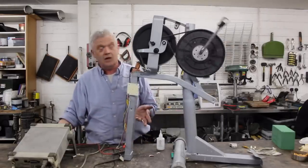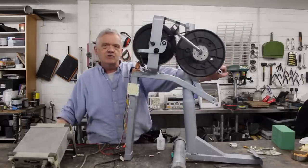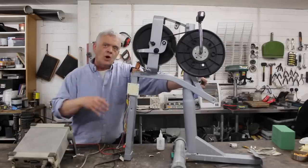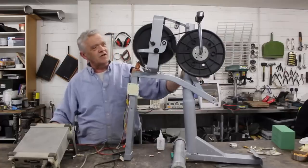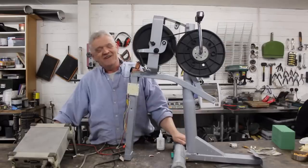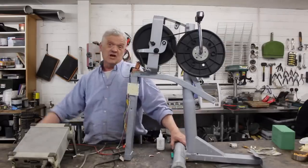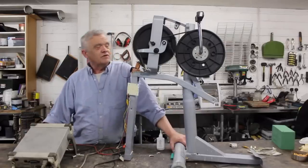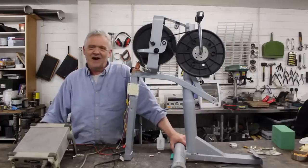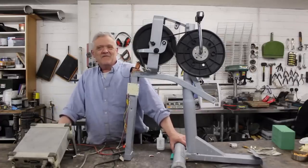So if I want 120 watts, I put 10 coils around and connect them in series or parallel depending on the voltage I want. Given that the army field generator is only about 80 watts and you've got about 60 watts of arm strength available, 100 watts is about what you can realistically get. If you put on all 10 coils you'll probably find you can't actually turn it. All I've got to do now is add the other coils and put on a voltage regulator, just like in previous videos. That's my effort replicating an army field generator from an exercise bike — I hope you enjoyed the video, thank you very much for watching.